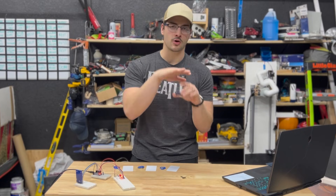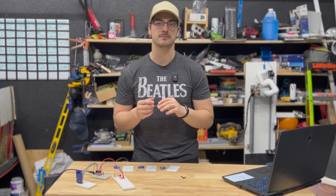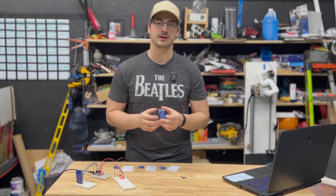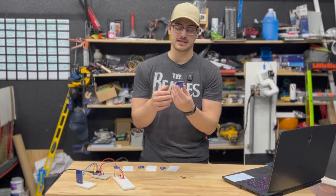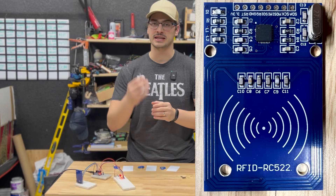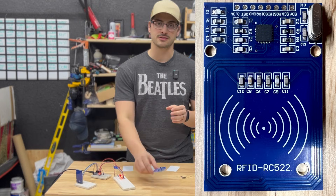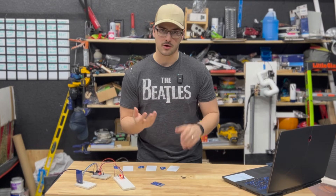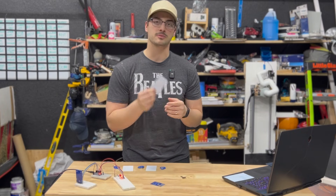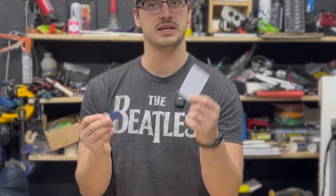All you really need to know about how an RFID loop works is that there is a master or powered active component that emits a radio frequency and looks for nearby devices to scan. For this application, that'll be this standard MFRC522 RFID scanning component. It uses a very simple 8-pin pinout, which is very standard for RFID scanners. Passive components like this key fob or key card don't require power — they have an RF signature but aren't powered, because all they need is to be near an active component that can scan them.